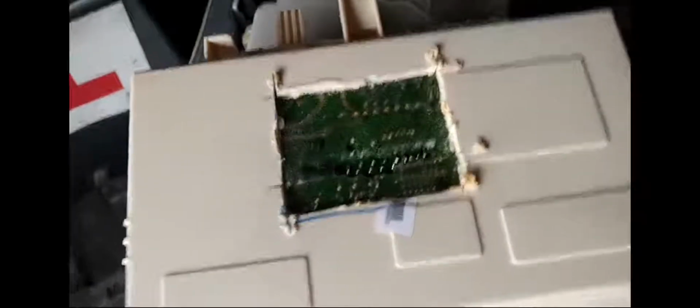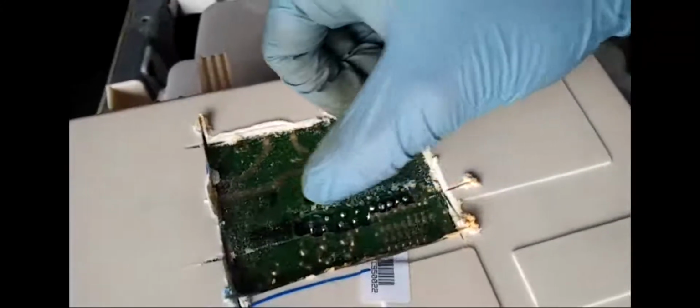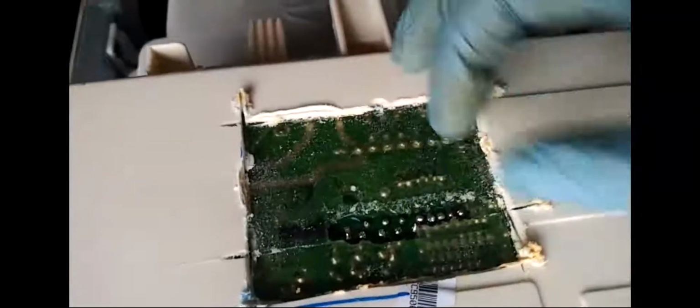I had to cut the back cover with the Dremel tool, and this is the silicon coating. I believe this is there to stop the vibration affecting the board, but I don't see the point. It's already affected it. It's not working, so there's the silicon gel in there at the back. The previous problem, as I said before, was it was throwing an E code error, would get stuck, and I had to switch on and switch back again. So I'll remove the silicon coating only for the main IC there with the black heatsink. Can you see those connections? Those are the ones I re-soldered.